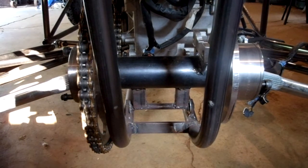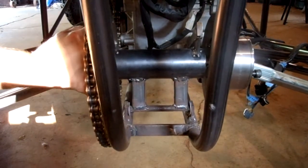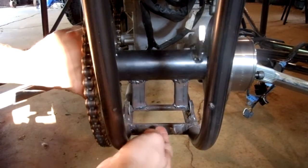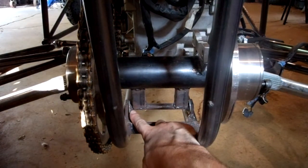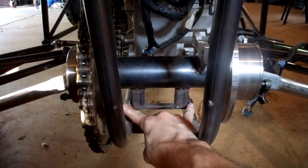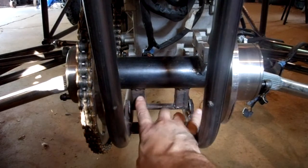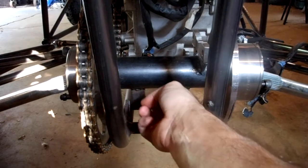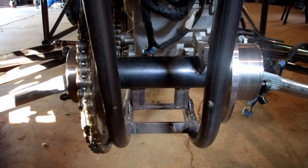So this is what it looks like from the back. As you can see, move it forward and it goes back and forth like that. This is a pivot point here — there's a rod here with just two brackets, one on each side that's got a hole in it, and that's what it pivots on. And then this is just a square, one inch square tube that's welded onto my center axle carrier here. So that's how it pivots.